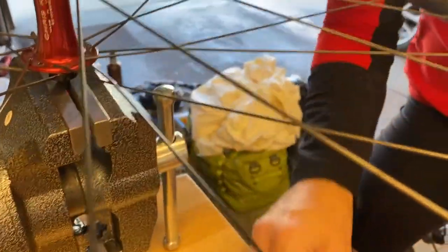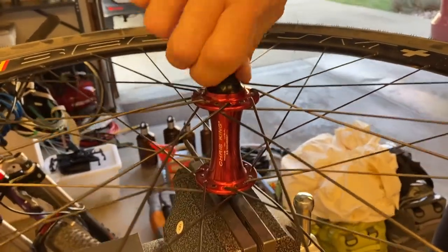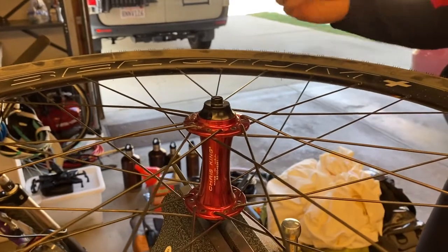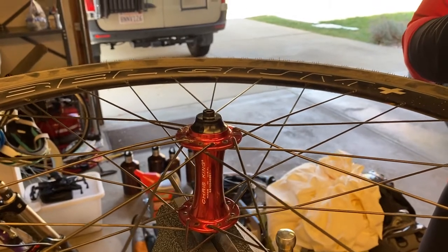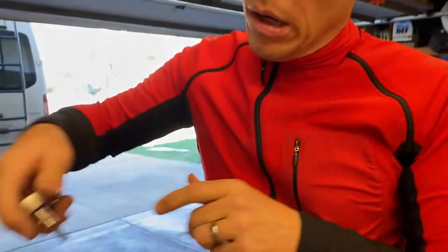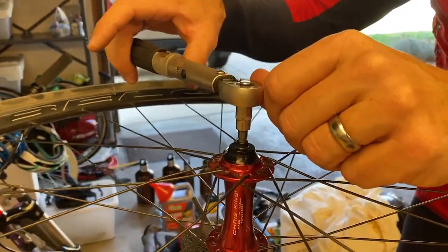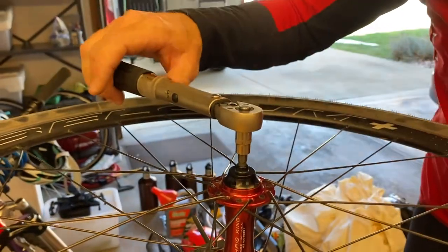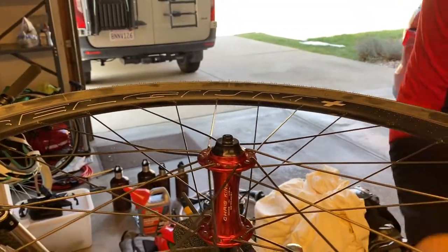Take the part off, put it down, and then put the outer cap back on — this is where you need the torque wrench to do it the right way. The torque rating is about 11.4 newton meters. I do it just below that, but these things are plus or minus at least 10% so it's not going to be exact. Put it in there — there we go, it's torqued down. Pop it back off.